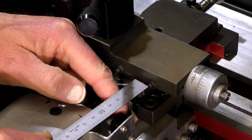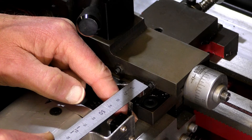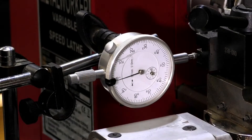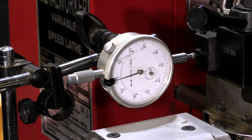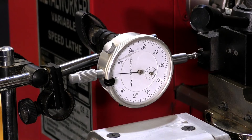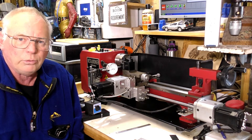There you go — that's pretty damn good. Not much in it, maybe a couple of thou. I've just altered it another five steps, taking it up to 805 steps per. Just brought it down a little bit. I'll keep altering it — I'll get this perfect. Well, that's within a thou really, in real terms, even on a long stem.